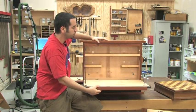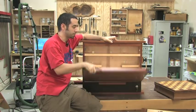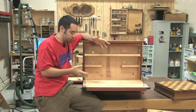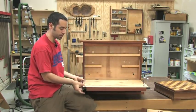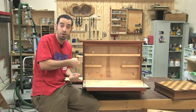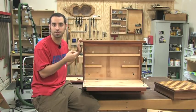If you open it up I can show you where I did wind up going wrong and things I'm going to fix in future generations of this piece. All this is ply — it's all very stable and the shelves have held up really, really nicely. The top is in really good shape. This piece here was just a design concept — I thought when it's hanging on the wall it might be cool to put a laptop on there and type away, but who does that, right? It really turned out to be an interesting concept but not really a great idea in practice. One of the main issues here are these chains. Since this shelf is actually a piece of plywood, driving a screw in there and having all this weight on it over the course of a couple years really puts a lot of strain on those layers of ply, and you can see it's pulling up. I really think someday those screws may just pop out. Thankfully this didn't go to a customer — it's just in my house and I can monitor it and it teaches me a lot about what not to do in the future.